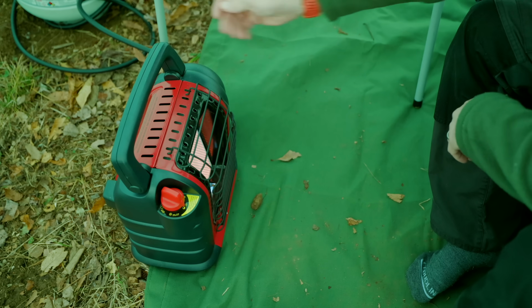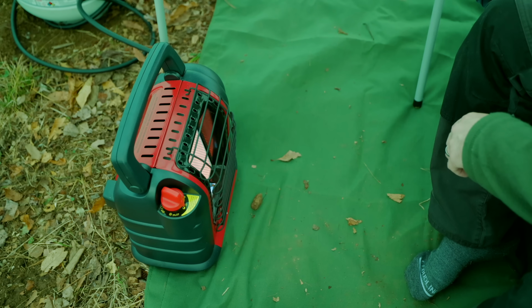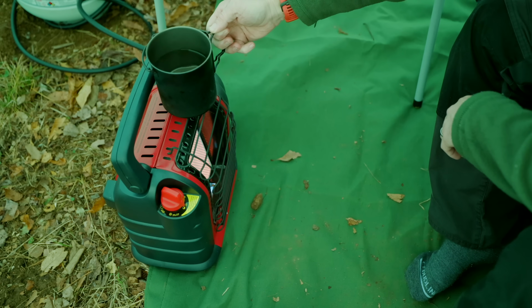And that takes us over to the cons that I have for the Heater Buddy, starting with the hoses that are available for this system. I've mentioned already that initially I had a red Heater Buddy. With that heater, I ran 1-pound cylinders and also 20-pound tanks. When running with those 20-pound tanks, I would use an optional hose that did not require the use of a filter, but yet using that hose is what ultimately tore up my system. And that is why I have the green version here.